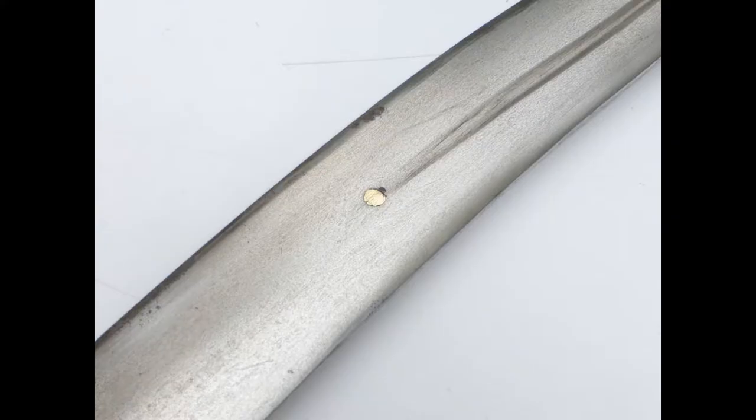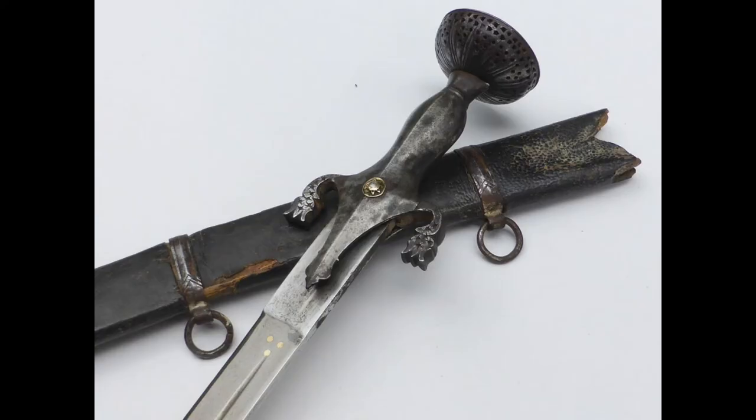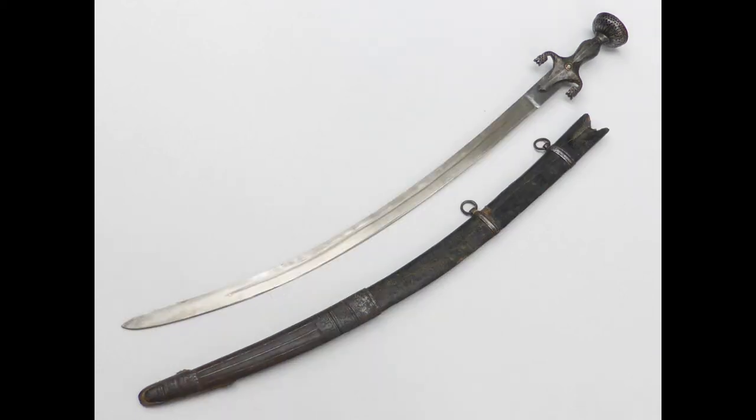As noted before, I've not re-etched this, so you can't see the distinctive join between the Wootz blade and the wrought iron as you can in the previously shown image. However, you can see that there is a distinct lack of patterning in the tang which is visible in the blade. This is a mid-18th century blade and it has characteristically crystalline Wootz rather than the more dendritic Wootz I've shown in previous examples. In terms of quality it's likely quite similar, and it remains sharp to this day, probably having been resharpened at some point, evidenced by the lack of patterning on the edge. I do have another sword also made of Wootz which has not been resharpened and is still quite sharp — I'll show that in another video.